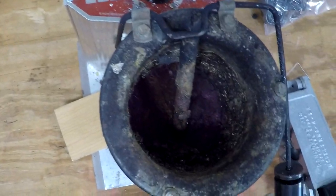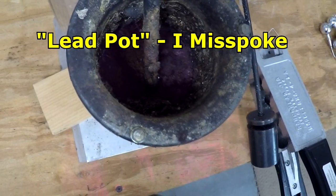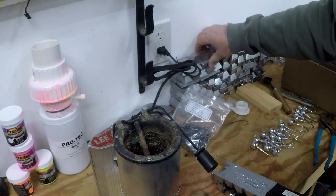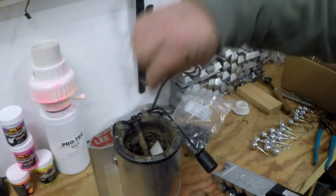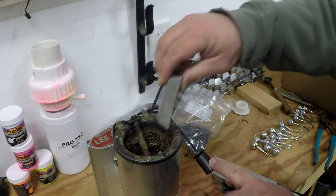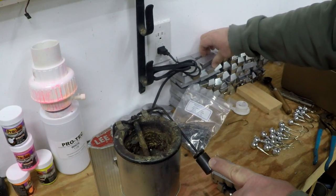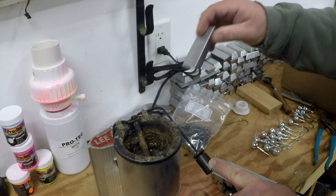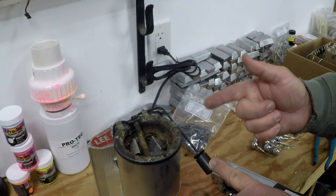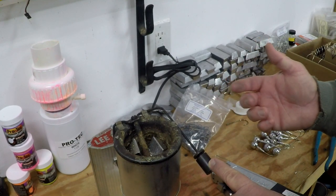Here's another tip: don't run your mold dry. When it gets low, now is when you start adding in your little nuggets that you poured in the cleaning video, very carefully. This is also a great time to go ahead and clean up your scraps, and this pot will be ready to go when you are next time because you didn't leave it empty. This lead melts really well when the pot is good and hot. This pot holds about six pounds of lead, so we've poured close to probably five pounds of jigs.